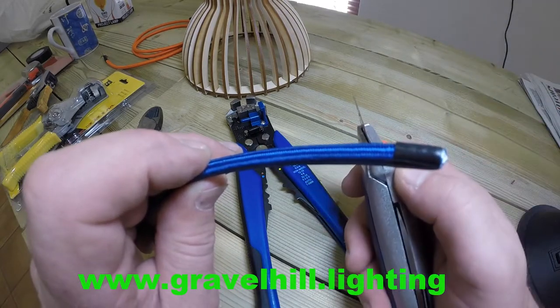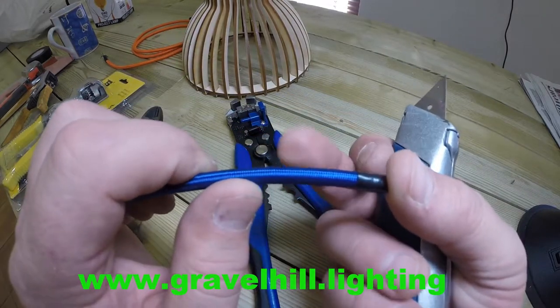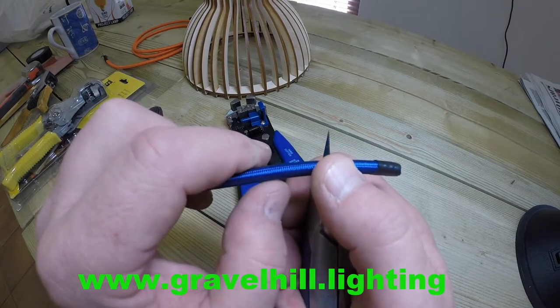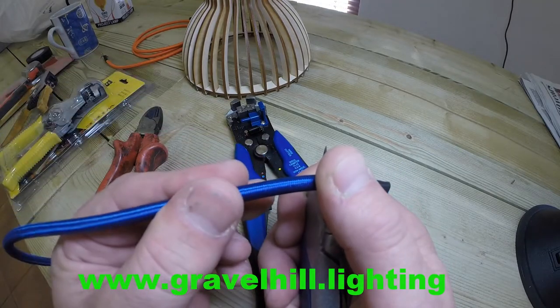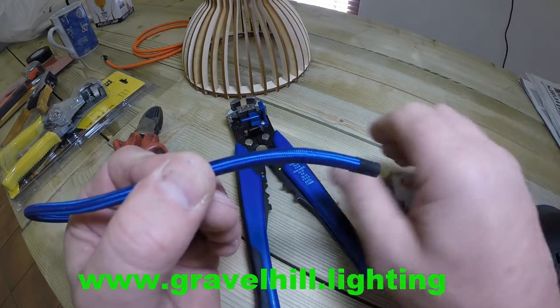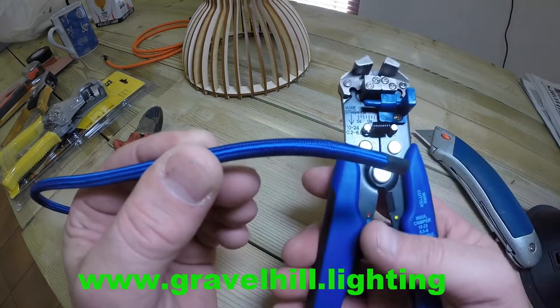To do the cable, I suggest you go about 30mm into the cable, very roughly, and rest the blade on that and very gently just twist it around, so you put a light score all the way around the cable. This breaks the fabric cable and puts a little marker for this tool to do its job.